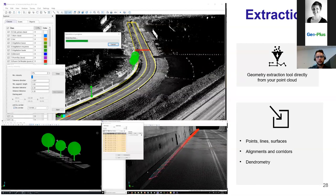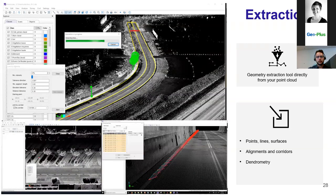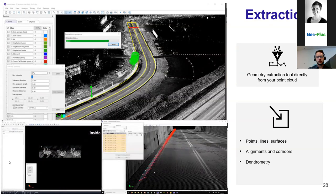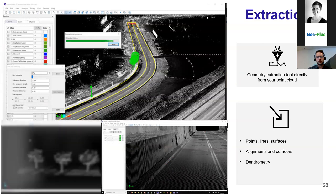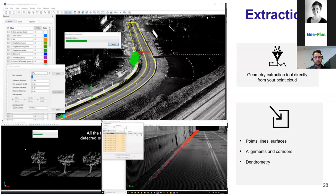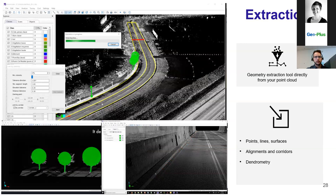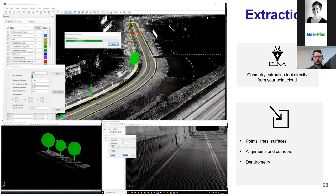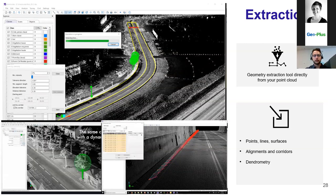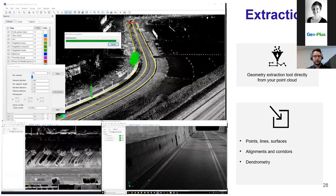As you can see on the top of the screen, we created a corridor and asked the software to automatically locate all road markings. For tree detection, shown at the bottom left of the screen — any trees from which we can see the trunk, which is greatly achieved with the PX80, can use the tree detection feature to automatically extract your trees. Once a tree is extracted, it creates a 3D object importable into other software such as Revit, and gives you a list with all tree dimensions including trunk height, diameter at breast height, tree height, and crown diameter.